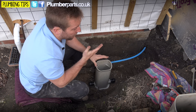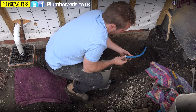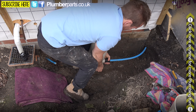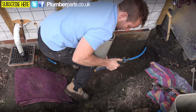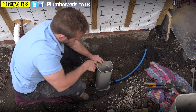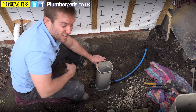All I've got to do is cut that pipe back to the length I'd like it to be. Don't ever cut too much off because we can't add it on. I'm going to pop my insert in just like so, lift this out, pop that in there. I'm just going to nip that up a little bit and then grab a proper set of grips and give that a good nip up — this wants to be pretty tight. I might have to dig out a little bit more here so we've got a nice sweeping run-up and it goes nice and straight into that coupling.